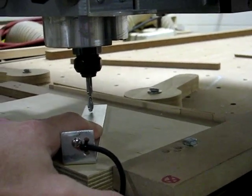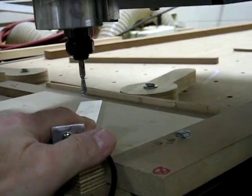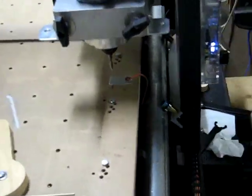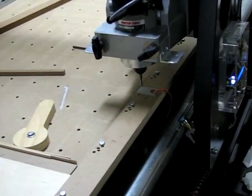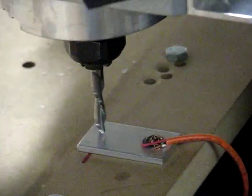It backs off and zeros real slow to get a more accurate reading. Now remove this and I will go over to the fixed plate — I've got a fixed plate mounted on the side of my machine where I have a little fence to reference my Y zero. Now the tool is getting a reference position for future tool changes.